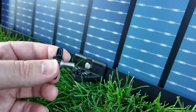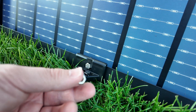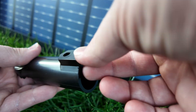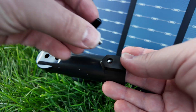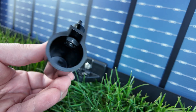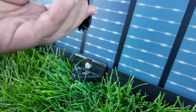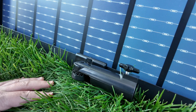The next parts you're going to need are this little finger nut with the black plastic end, and this other nut that does not have the flat bottom — it's equal on both sides. Here's this other plastic piece — notice there's a little flat spot right up in there, so this nut just slides up there. Then take this nut and start threading it in. Don't thread it all the way in, just enough that it stays in place and holds that nut on the inside, but you need it to still be able to accept one of these legs so it needs to be able to slide.